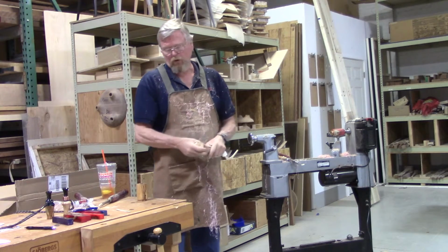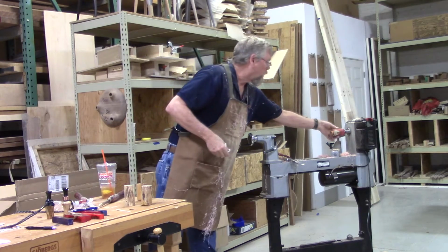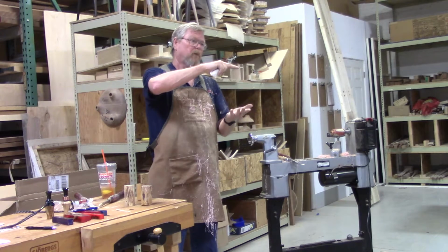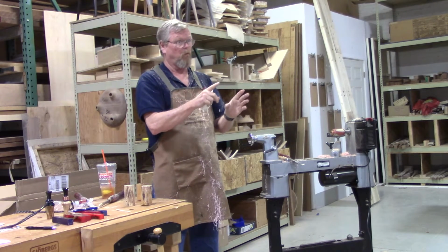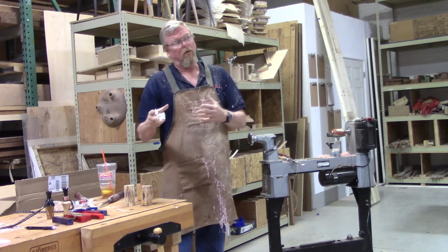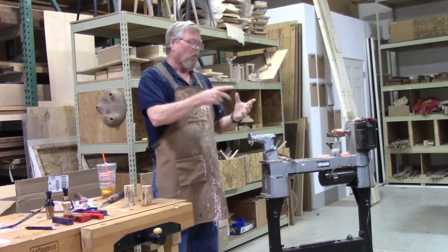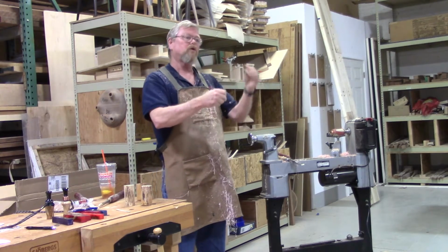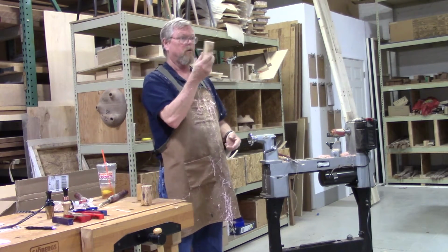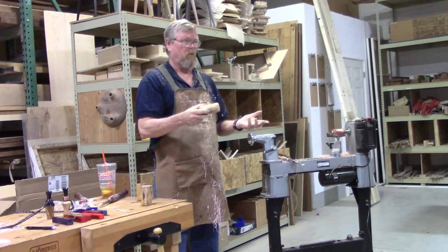And what that's going to do is once you turn on that pump, it's hooked up to that tank with the liquid in it, the wood is submerged in. Look it up on YouTube, wood stabilization. It's something to watch because to do it here in a demo, it takes 3 days, the different steps. But once you turn that pump on, it's going to foam up and bubble up. It's going to suck the air out of this wood. That vacuum pump is going to suck it all out. It could take many hours.